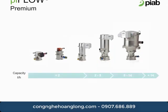The piFLOW product line covers material transfer capabilities ranging up to 14 tons per hour. This max transfer rate is wholly dependent on the material characteristics and transfer distances. Our actual typical sweet spot is closer to the range of 100 pounds up to 6 tons per hour. The capacity of the vacuum receiver is largely dependent on the volume it can hold, the transfer line size, and the pump size. All these features make the piFLOW an ideal candidate for a huge range of customer applications.